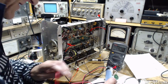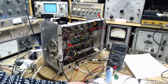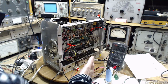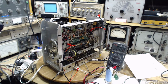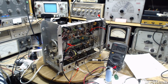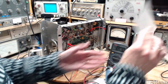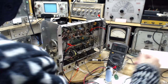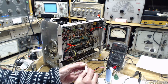Well, they do, and that's not surprising, because this is where the power is needed in the radio. The power is needed to drive the speaker. The speaker requires power. Not much else requires power in here. So they've set up the power supply to deliver a higher voltage, 40 volts, and that's okay. I was just wrong. It wasn't written on this schematic. They're trying to trick me.